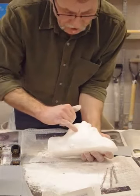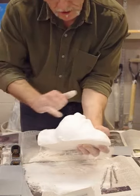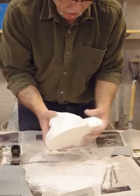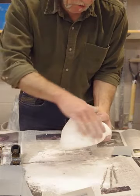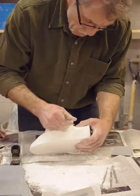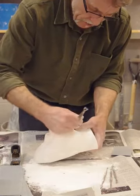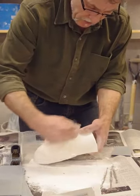There are a couple of pits — you see there's a pit right there. What we're going to do is we're going to fill those. Now that we have that sanded smooth, what I would suggest as probably the best strategy would be: don't stop here, but go over the entire surface and keep taking material off where it needs to come off — smoothing down the entire thing before you fill the pits. That way you're using your time more efficiently and not stopping to change tools every few minutes.